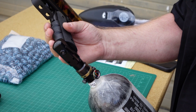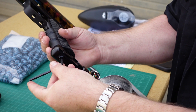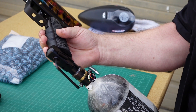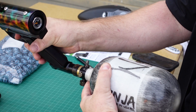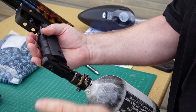Remove the ring here. Now, counterclockwise goes up, clockwise goes down. So all the way clockwise and the reg will be pretty much shut off. I'm going to go ahead and gas it — see, we don't have anything. Had some residual from the last time I shot it, but the reg's off.